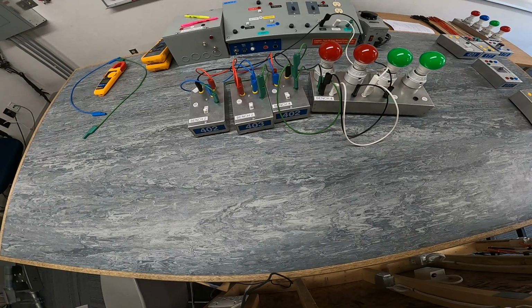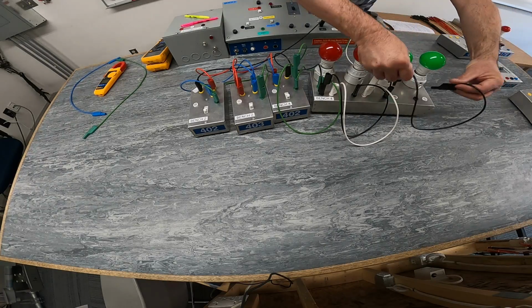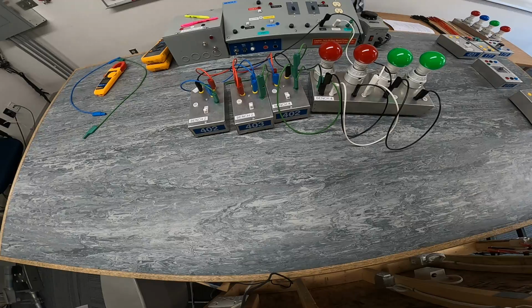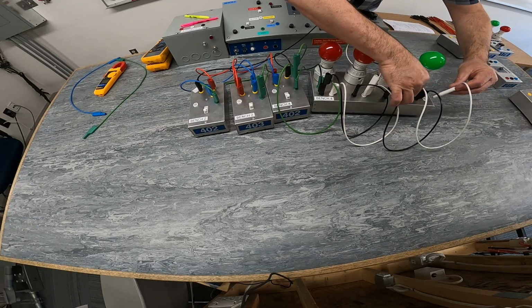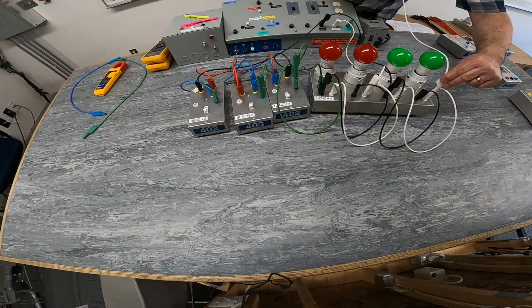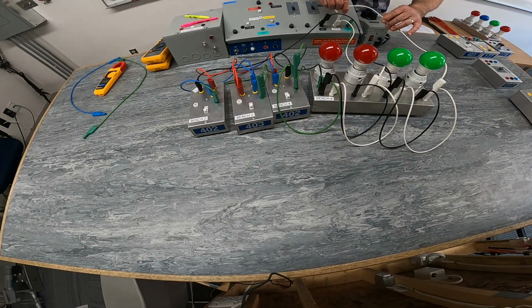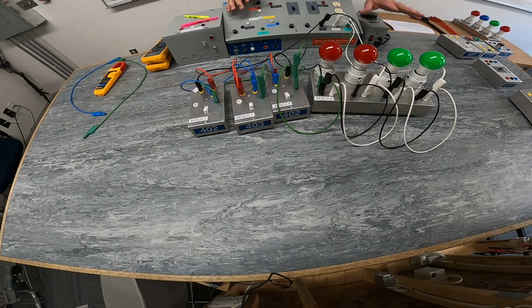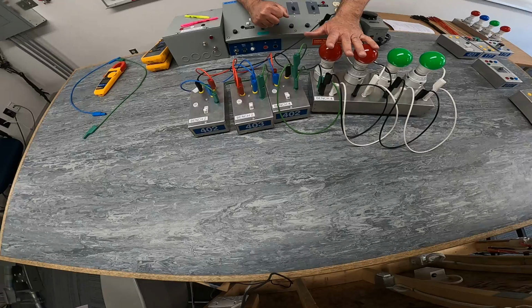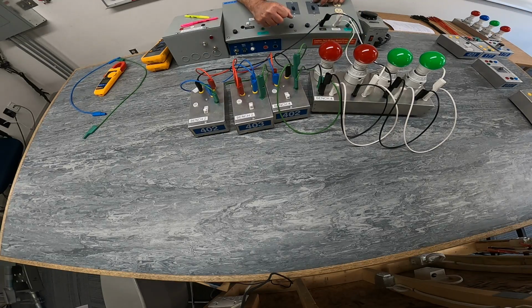Because these green lights are going to be simultaneously coming on together, I am going to parallel the black connections. I'm also going to parallel the white terminals, and also on the two green lights make a connection back to the power supply, being the identified connection. So these two green lights can represent, for example, two plugs or receptacles that stay energized all the time while we are switching just these two lights from 3 different locations.